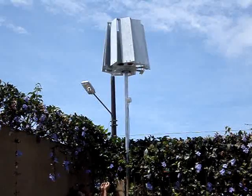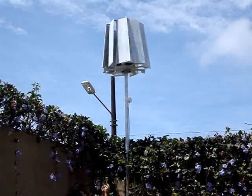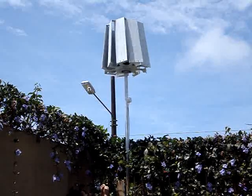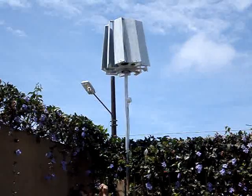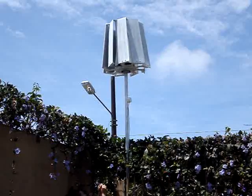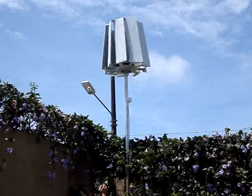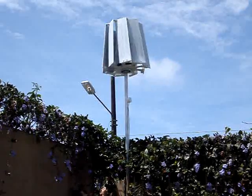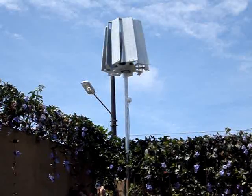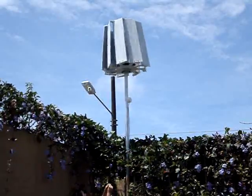It's actually sort of acting like a sail. So I'm probably going to change the blades and use the same hub center but change the blade design. Right now I'm showing the braking effect of grounding out the leads — it comes almost to a dead stop and then starts back up fairly quickly. Once I change the blades and get this thing spinning a little faster, I'll wire up some kind of overspeed braking system.